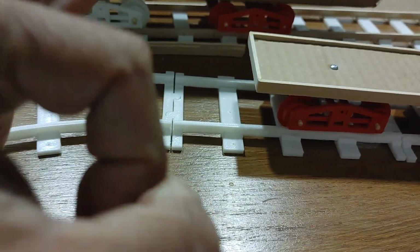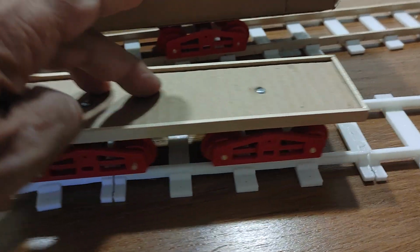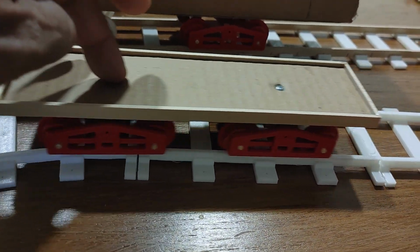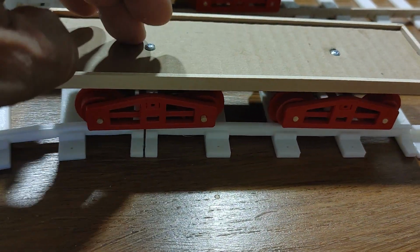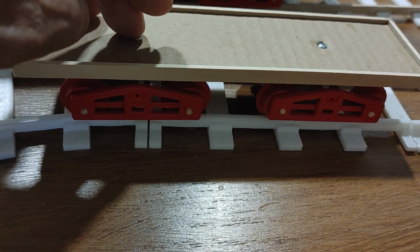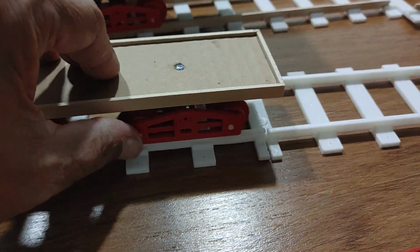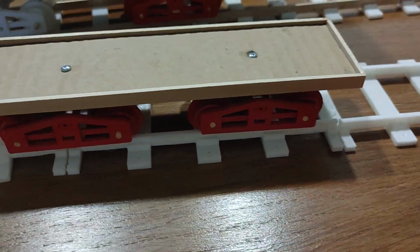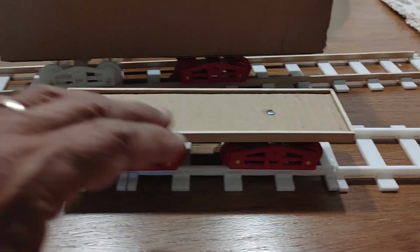The skewer is not perfectly circular on the outside. I mean, you could take that on the lathe and just trim some of that, but to avoid that, it's just better to use the proper, more precise axles that you can get using 3mm carbon rods, or brass tubing, or even steel piano wire. And so that's going to be one of my changes as I progress into completing this train set.